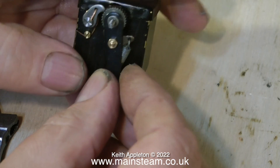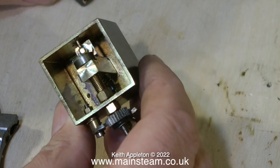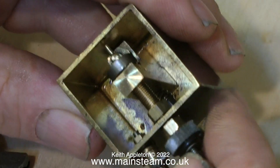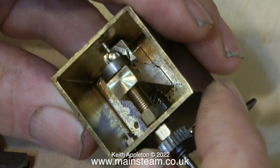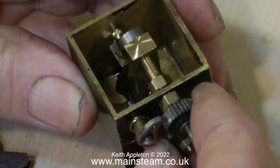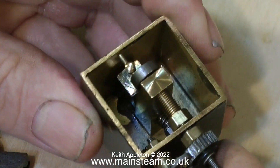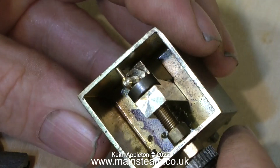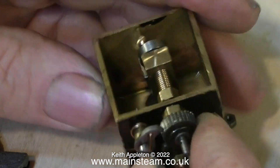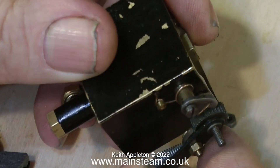There are also some types which use an eccentric on the shaft that depresses a spring-loaded pump piston. As you can clearly see, this uses an oscillating cylinder as a pump, pretty much like on a toy steam engine. I think it would be possible to make this run as a steam engine by fitting a flywheel and feeding compressed air or steam into the outlet, but I want it to be a pump — and it hasn't been a very good pump up to this time.